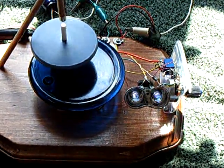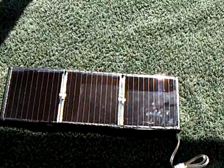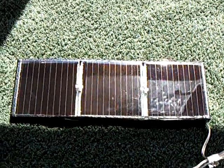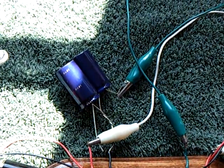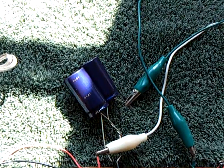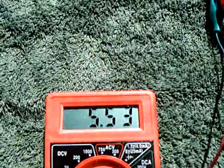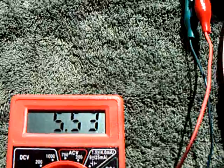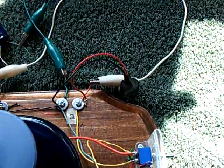What I've got this running on right now is a little solar panel I made up for one of the other projects — it's three 3.5-volt cells. I've got it feeding a couple of super caps that are 2.3-volt, 22-farad super caps in series to give me enough capacity, and that's what's sitting on the caps right now with the two capacitors combined.